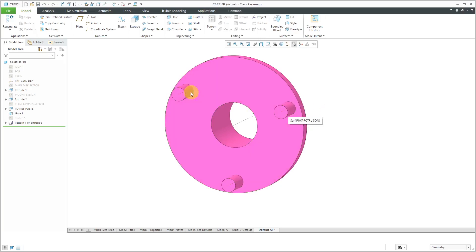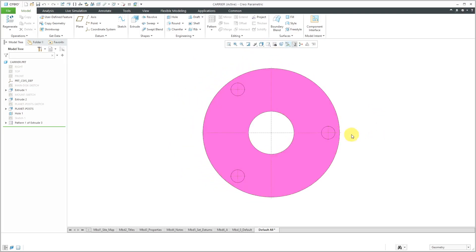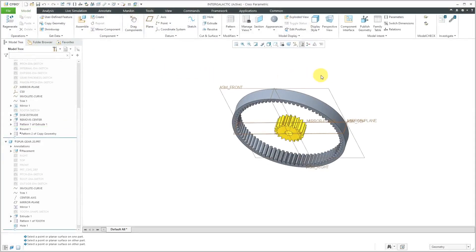Initially, I assumed that if I wanted to have three gears, I would just automatically space them evenly about 120 degrees from each other. But it turns out that there's a formula that you have to use. In this particular case, I have one post at zero degrees, but the other two are actually 108 degrees apart from each other, so they're 126 degrees apart from that one. Those conditions are necessary in order to get proper meshing and the formulas are available online for figuring out what angles you want things to be placed at.